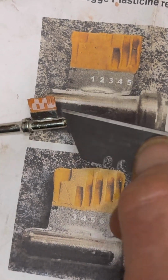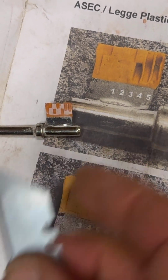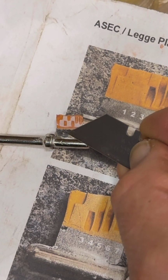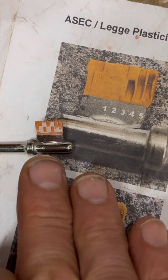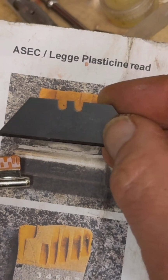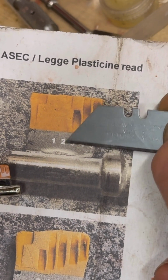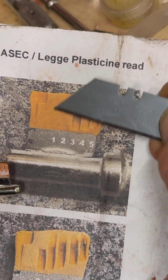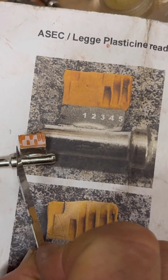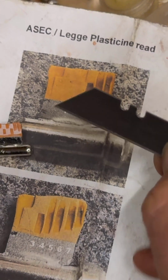And then if you look at lever number 4 in the middle there, the second one in from the bolt, you can see that it's actually left a mark at the top of the key, but there's no mark at the bottom. There's only one lever in this lock that will leave a mark at the top like that. Normally it's a little bit smaller than that actually, and that is actually lever height 2. If there's no mark whatsoever, then it tends to be a 1, but that's probably going to be a 2. So we've got 4, 2, 4, and then we've got 2 marks there,